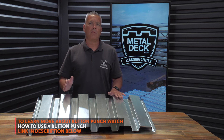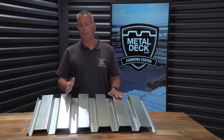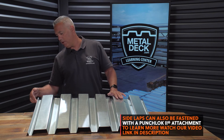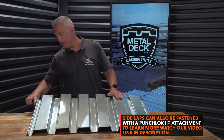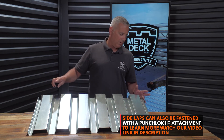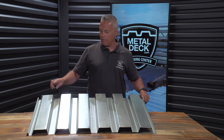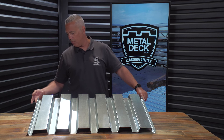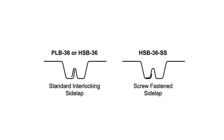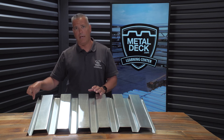The other type of side lap that you'll see — and you won't see it often — is called a stitch screw side lap. What they do is take the female side lap and extend it; there's a little leg that comes out from here. On the male side lap, it's actually about half the size. They decrease the male side, and the metal that's left over is how they come up with the little leg. The purpose of this is that when you lap the two together, instead of button punching the side lap, you'll put a screw through the end.